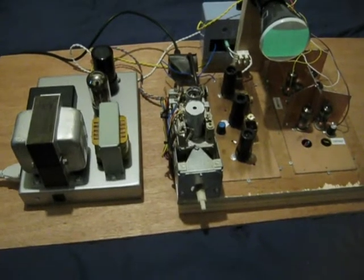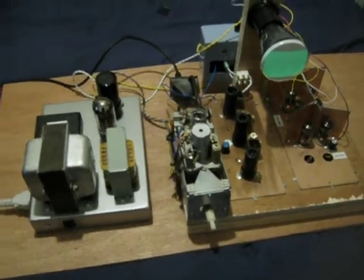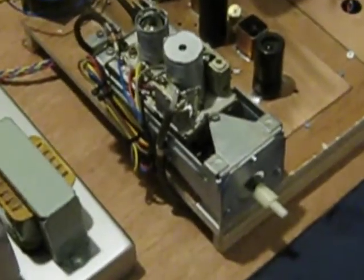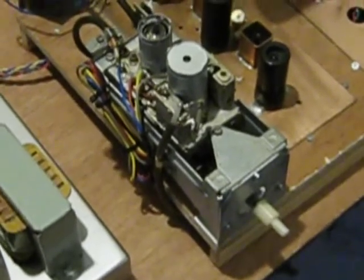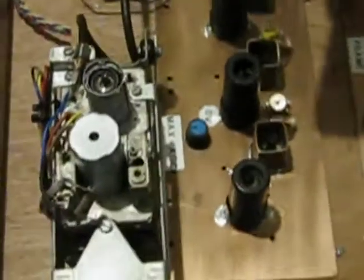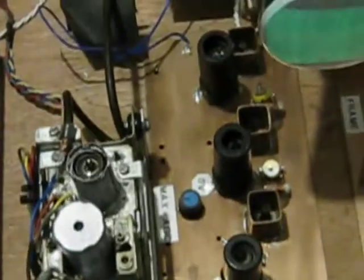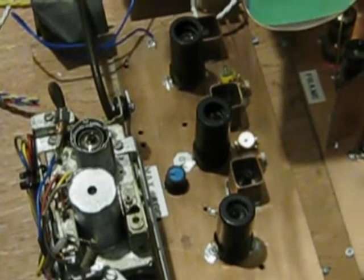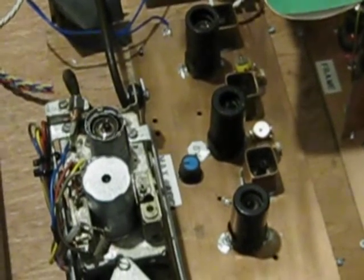My prototype homemade TV. The power supply is so I don't have a live chassis. I've had to do a separate heater transformer for the CRT. This section is a tuner off a 1950s TV. Video section. Not built an audio section yet, and the pot there gives me the AGC point for the tuner. That makes life a little bit easier for me.